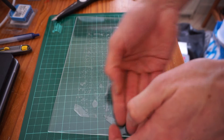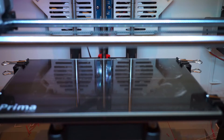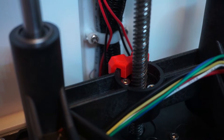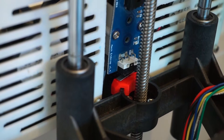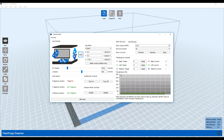My heated bed is fitted with BuildTak, so I used the glass plate to allow me to easily apply and remove the tape. The glass plate adds around 3 mm of thickness to the bed. A shim can be used to offset the z-homing position by the correct distance. I printed several shims with slightly different thicknesses and used the printer control software to find the correct offset. The program allows you to move the z-axis in small increments and find the z-value at which the micro switch triggers. I will share the model of the shim on my website — link in the description below.